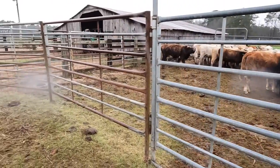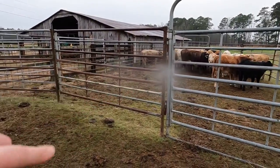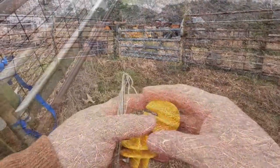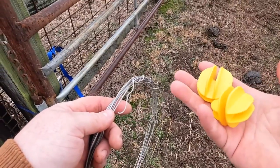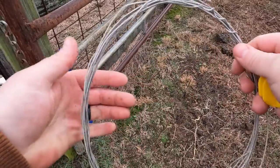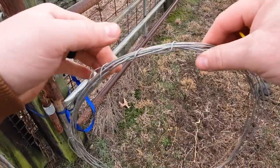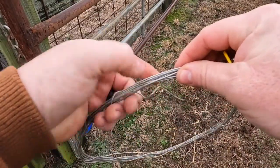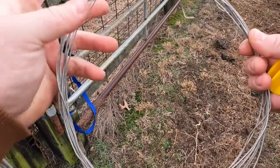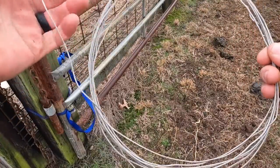That's why it was so important to put that division fence in this little pen. Now all these ladies are locked up over here and I've got access on this side. First things first — got our two insulators, we only need one right now, I'll stash the other in my pocket. We need a bit of this wire. It's pretty small gauge, not exactly ideal — a little larger gauge is better — but this is what we had handy in the truck.